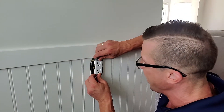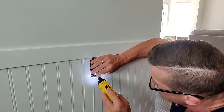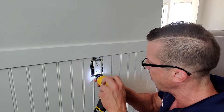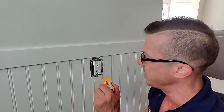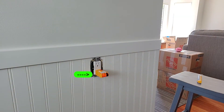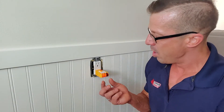Let's push this back in the box. You want to make sure you put it nice and straight — you don't want a crooked outlet, it's going to look unprofessional. Now let me put my outlet tester in here. Right now we have no power. I will go and turn on the power, and if everything worked out perfect, these two lights should come on. Success! As you can see, these two lights are now yellow, and that means that this outlet is wired correctly.